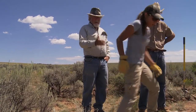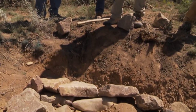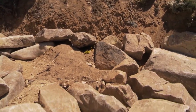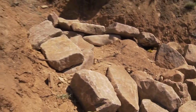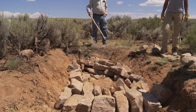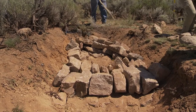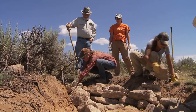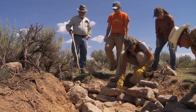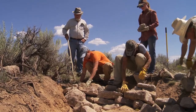We want to maintain this angled arrangement so they don't end up flat — keep them angled all the way around with each additional row, up the bank. All these rocks slant into the hill; you can see how that's working out nicely. We need another row to get to this elevation — not higher, not lower. They may need to be book-stacked to make them work.